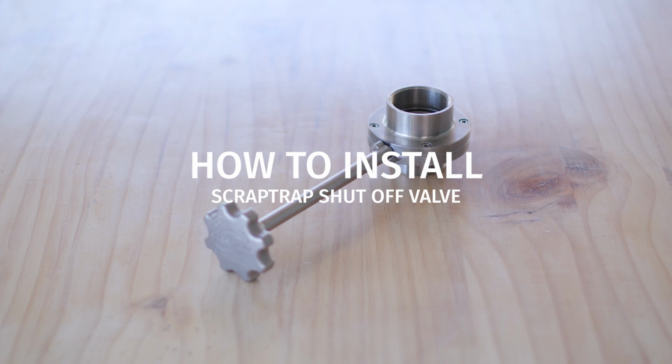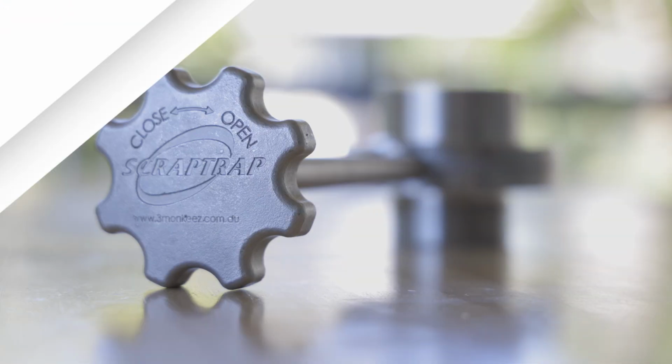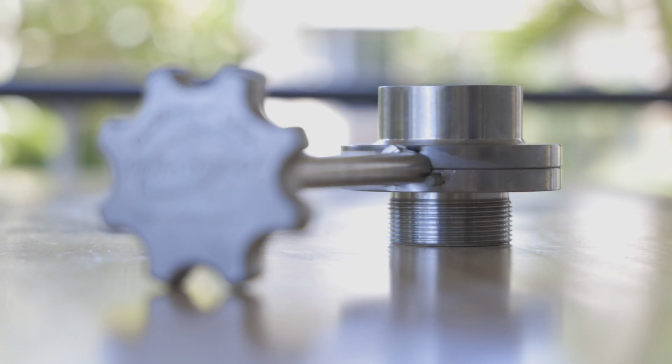Install the 3monkeez ScrapTrap Shut Off Valve. It's important to only use a shut-off valve on a fully stainless steel scrap trap. Firstly, apply thread tape or thread sealant to your shut-off valve.